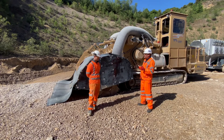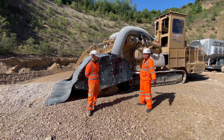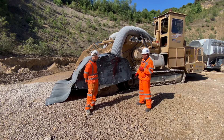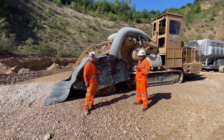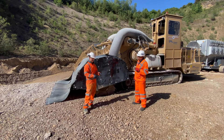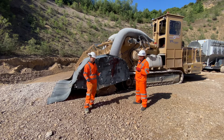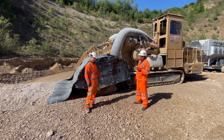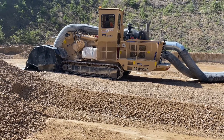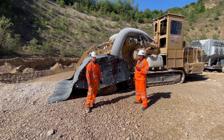There are offices there and a village there, so we've got to do it in a different way. The machine can dig anything up to 450mm deep in one pass. A shallower and faster cut can give you a larger aggregate, but for Breeden here they like a small dusty aggregate, so we dig a little bit deeper, slightly slower, and you can produce this sort of material which is perfect for them. They don't have to crush it too much; it can be easily screened and processed.